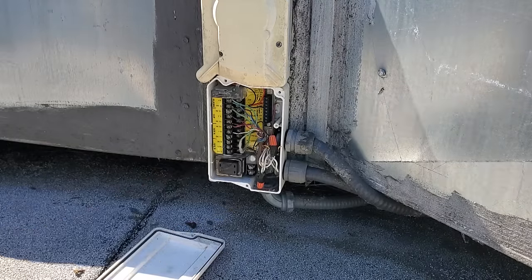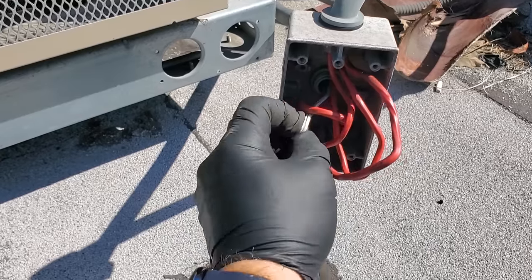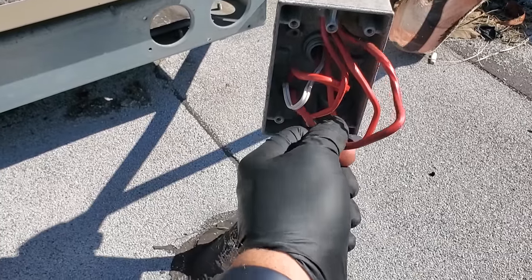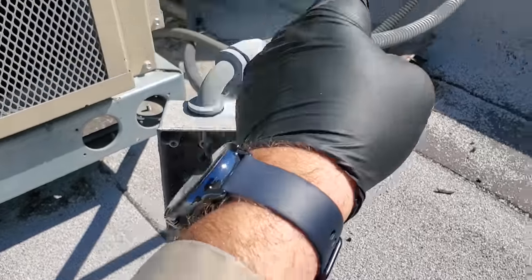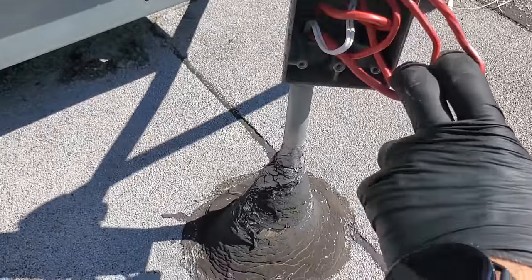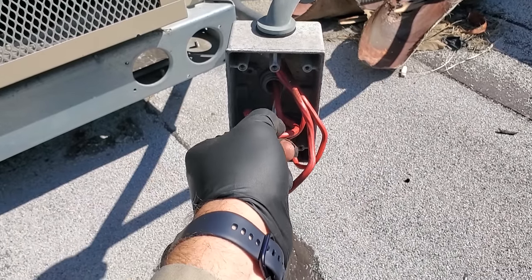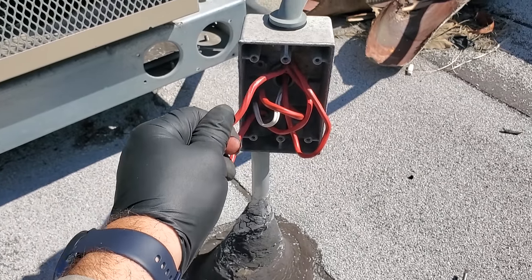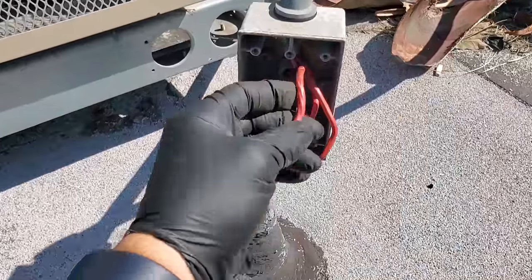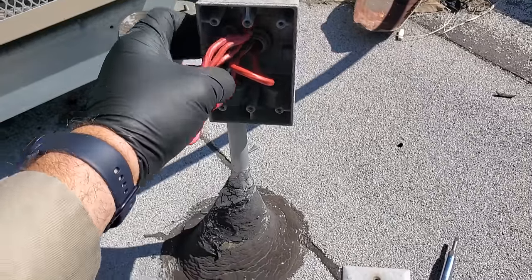This basically proves the circuit. From the looks of it we have what looks like an enunciator going to a horn in our alarm. Then we have one alarm wire coming up going into the first detector, one alarm wire coming out of that detector going to the other detector. Each detector should have a test and reset station wire, plus a main alarm wire tying the detectors together, and then there's an end-of-line resistor. I could make this work and wire it into the unit — it's just a matter of whether I have all the materials.